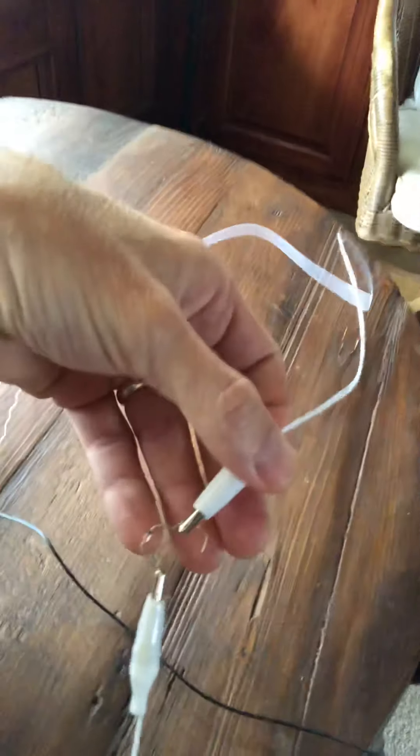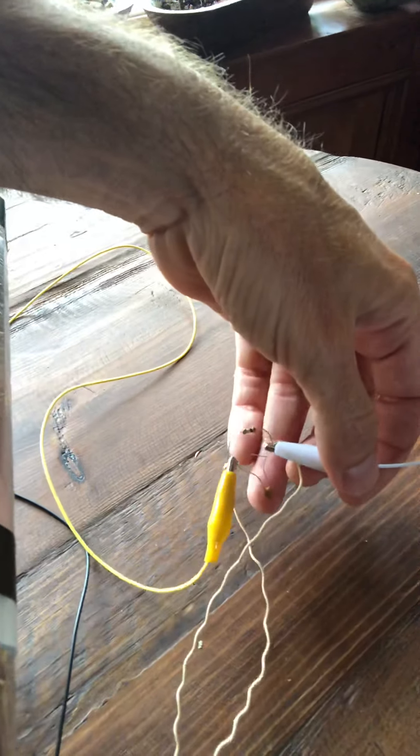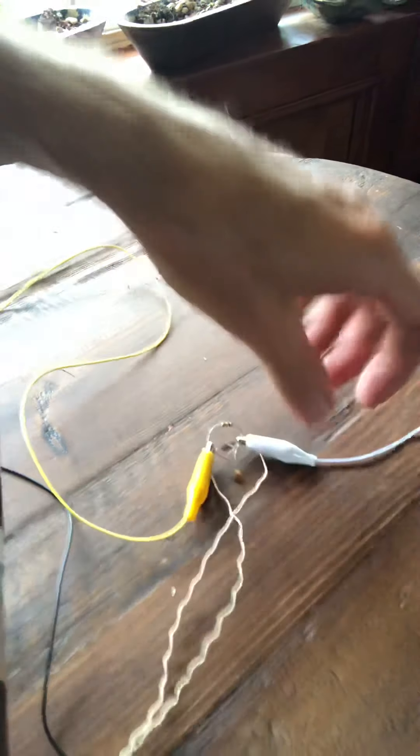The radio waves go through there and then into this wire, and from there they go to ground. Or they take this path over here and go through a diode and then through a resistor or capacitor in parallel, and also through the earpiece, which is this right here.